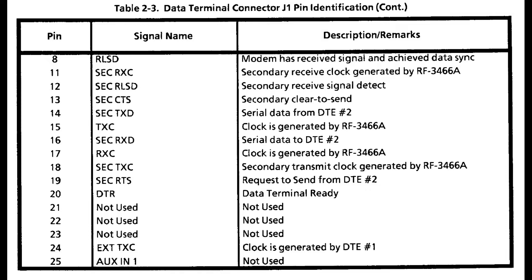I'll also note that this is a 25-pin connector and it makes use of a lot of the other pins beyond what you see here. Specifically, because it is a two-channel device, it has a second set of RX, TX, clear to send, and request to send — a whole second secondary serial channel — but we're not going to be using that. Now let's look at the transceiver and audio ports that are actually going to be connecting to the receivers and the transmitters.